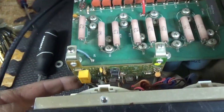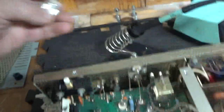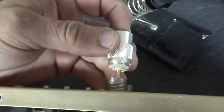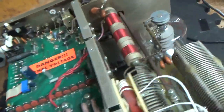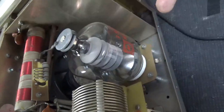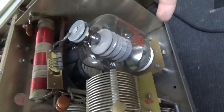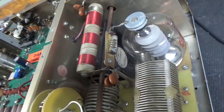The customer wants this grid overload board removed. I'm going to clean the contacts on the relay over here, and the soft start relay over here needs new SO-239 connectors — there's like no grip whatsoever. I'll change those, pull the tube out, high pot it, clean the contacts on the band switch and the input rotary switch. I'm going to remove the metal oxide varistors and add gas discharge tubes at the base of the socket between the filament and ground, in case the tube were ever to flash between the plate and the filament.